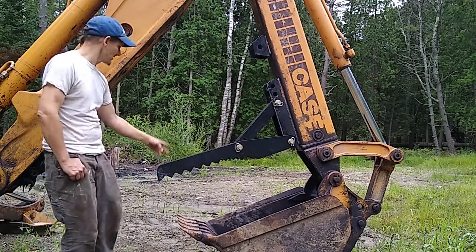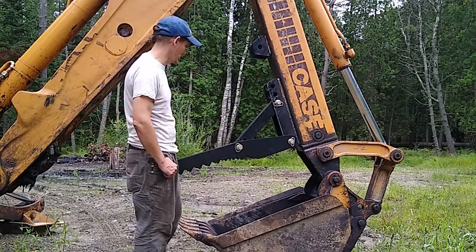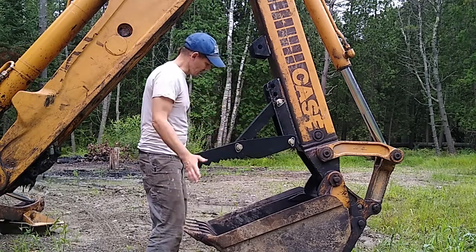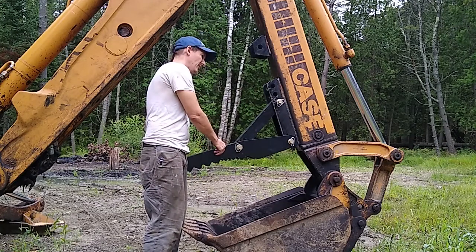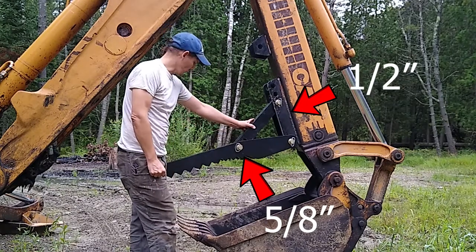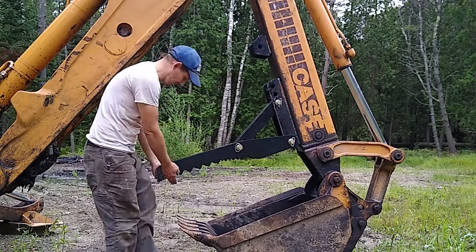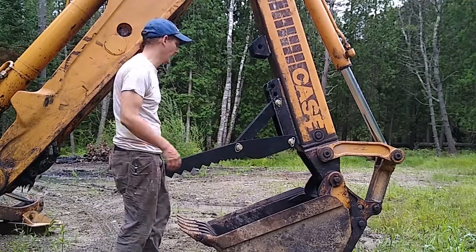This is actually all the way forward now, and there are only so many levels of going back. You have to be super careful to make sure that this doesn't hit the bucket because it's a lot closer than you'd think and it moves at a different rate. Also, this is about half-inch steel — it's very robust but also very heavy — so be careful when pulling these pins out that you don't have a limb between here and here because it'll break it right in half.